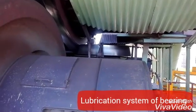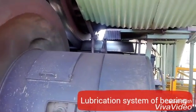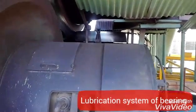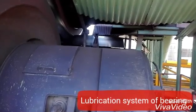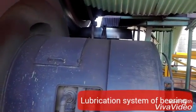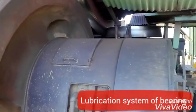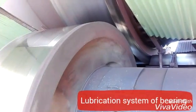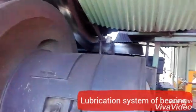What is the purpose of the thrust device? The thrust device basically stops the floating — it does not allow the kiln to move along its axis. The rollers provide radial support; they not only help in rotation but work on the friction principle.